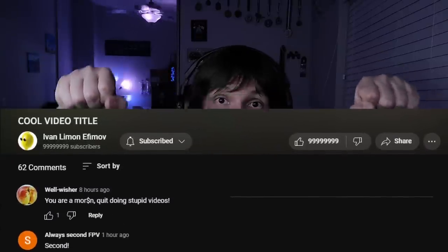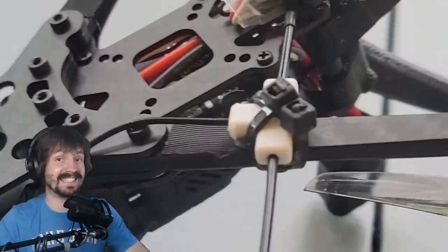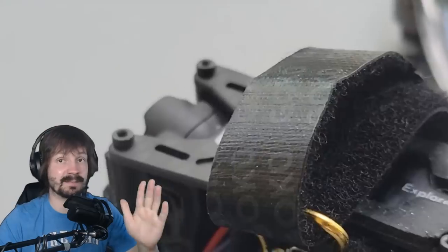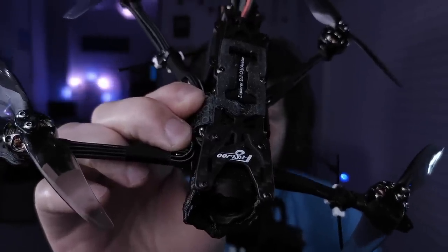Leave a comment under this video — maybe you have something to add. The first thing I want to get out of the way is these nasty socket cap screws, especially on the plate holding the battery. Imagine you crash this drone, the battery slides forward a little bit and damages itself with these stupid socket caps. Button head screws are a little bit safer and a little bit lighter, although you need to be more gentle with them and you need a good screwdriver. Before you do any modifications to your drone, make sure that it flies. Otherwise some companies would love to claim it's your fault it doesn't fly out of the box because you changed a screw.